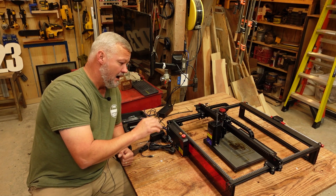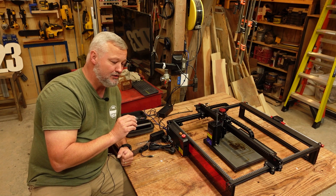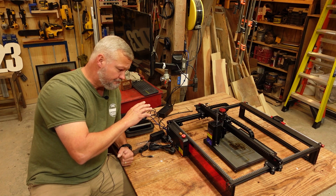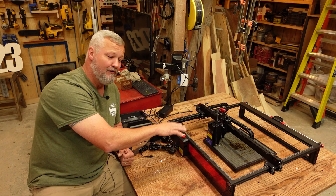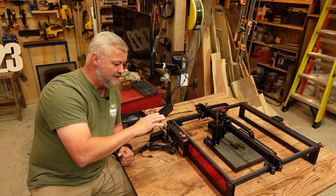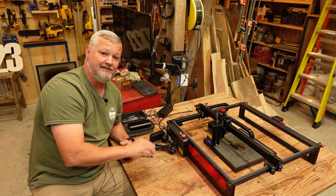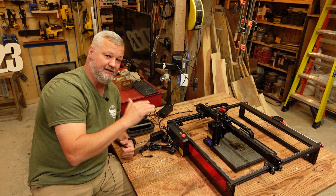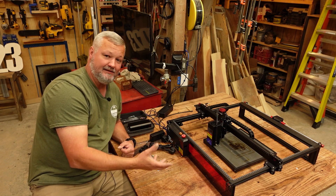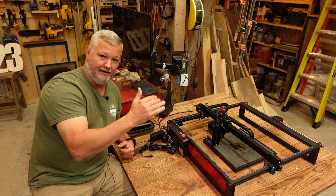This machine also has automatic focus as well as a powered Z-axis, and I've tested it in LightBurn. The focus technique takes a little getting used to because if you like to run absolute coordinates, you have to swap out of absolute coordinates. You basically have to run the machine out to where you want to focus it, focus the machine, and then either put it in absolute coordinates or re-home it before going back out to engrave. When you do the auto focus, it'll dip down — it has this little bar that touches the material, activates the limit switch, and that lets it know where zero is. Whatever setting you have in the macro, once it touches down, it raises back up to that setting, and that's your focus. You can also add and subtract elevation to the Z-axis on different layers and cuts, which is really cool.